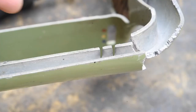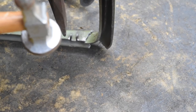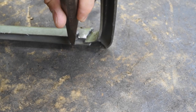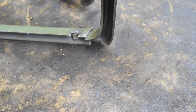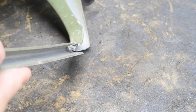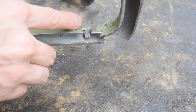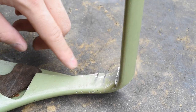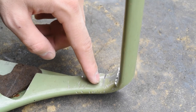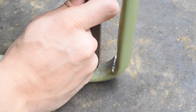There's the first of the two channels — I'm going to attempt to bend that inwards. It's going a little bit; it's kind of hard to hold this and we've got a crack. That's about as far as I'm going to take it. I want it in enough so that the aluminum will form around it and secure everything in place, but if I hammer it anymore that part will actually break off and I'll be back to ground zero. I've carved a second channel on the other side of the bend and I'm going to bend that one down a little bit as well.